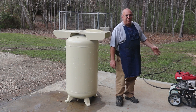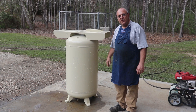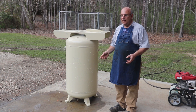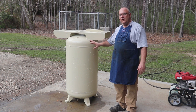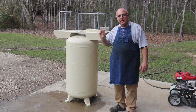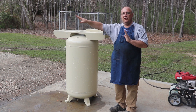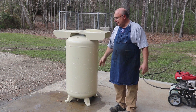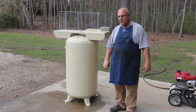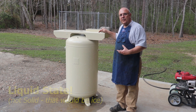This pressure washer is capable of going up to 3,000 PSI, and we only want to be at about 200, so we'll be taking little short bumps with it and hopefully get close to that 200 PSI. If by chance the test would fail — because we're using water rather than air — if you actually get pressure to release, because there's water inside the tank, there really is not that great a risk of any kind of explosion. As soon as you get any leak at all, the water pressure inside the tank will almost instantaneously drop, because once you get a place for that water to go, it's going, and then you're basically back to just atmospheric pressure, which is not dangerous. Water's not wanting to expand — you get a little leak, pressure drops down, everything's cool. It's a lot safer to test with water than with air.